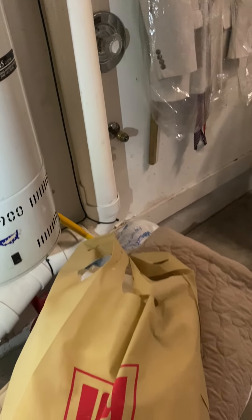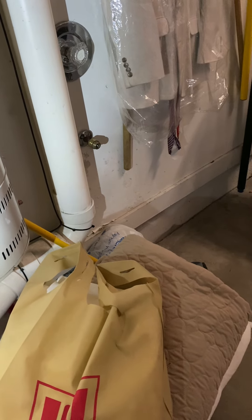The vent for the downflow furnace — about last year in the storage room in the garage, the hole right there — they re-roofed, and I ran two vents through the roof for future. So this one's right there — it goes through the roof and just has a cap on it. What you're going to do is extend these down with couplings and come down where you need.